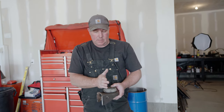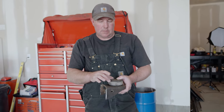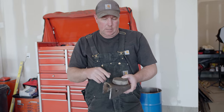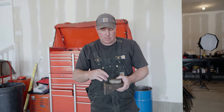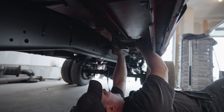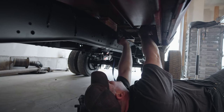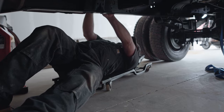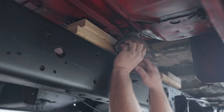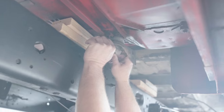The rear cab mounts are about two inches away from the frame, sitting right here snug. I think there's enough height that this part will come up over the top of the frame. I need to cut this, make sure the distance is right, clean it up, and weld it to the frame mount — should be good. Call it an inch and seven-eighths on both sides. That will fit, but I have to trim a little for clearance.